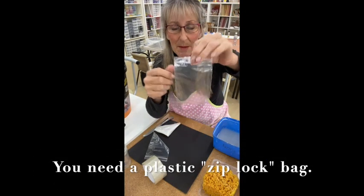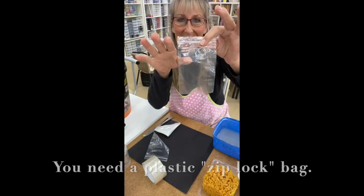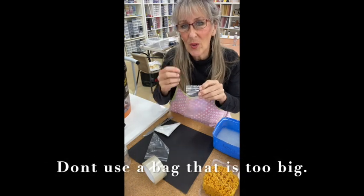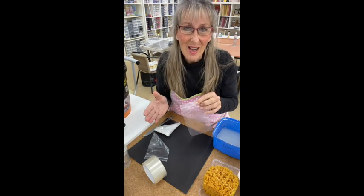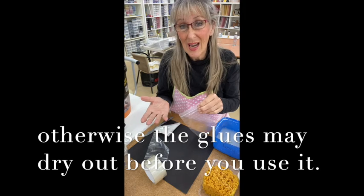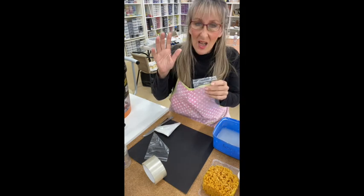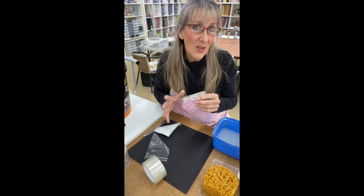You'll need a plastic bag that seals. So this is my plastic bag. It's roughly around about 6 inches by 4 inches. Anything larger means that you're going to be holding a lot of glue. So if you're going to be using a thin set, which only has a certain amount of life, what I mean is you can only use it in the first hour to 2 hours, then if you've got a lot of glue and you don't think you'll be going through it, a smaller bag would be better. The mastic adhesive doesn't go off if it's kept sealed, so I can use that large bag.